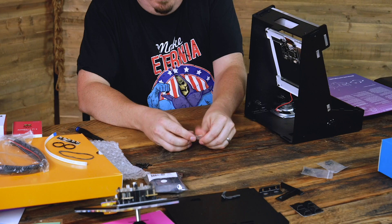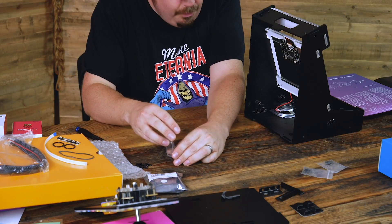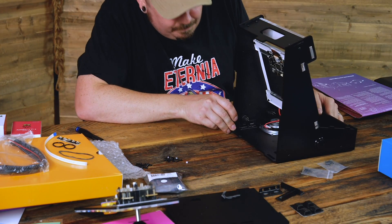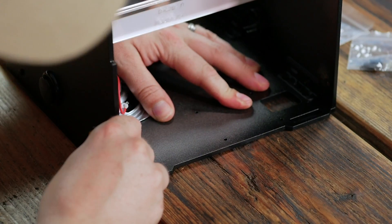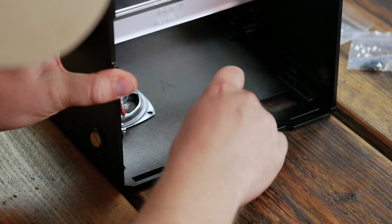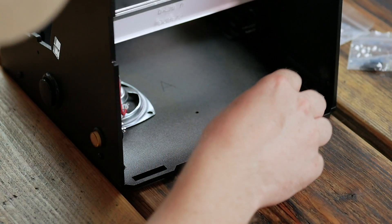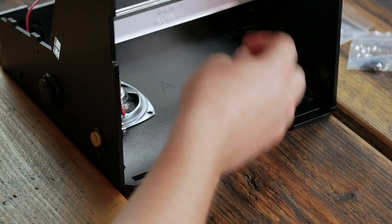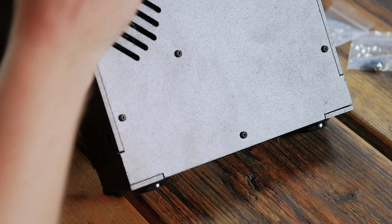Speaker is in. Next, we're going to mount the Pi. This can be tricky — we need more of the M2.5 bolts and the spacers. Shuffle those and make a fresh pile; a little plastic container would be handy. If we can get the Pi nice and flat on a surface, you can have the bolts poking through and then pop the spacers and then the Pi straight on top. It's going to be fiddly — probably best to have some masking tape handy to tack them in place.